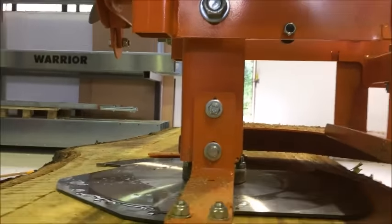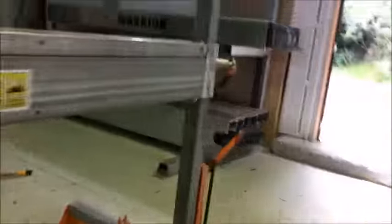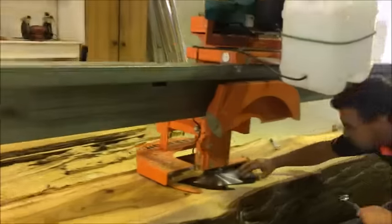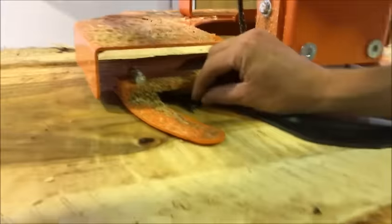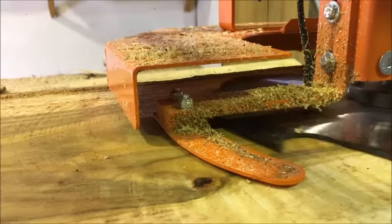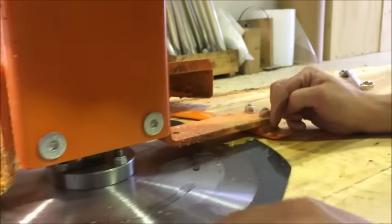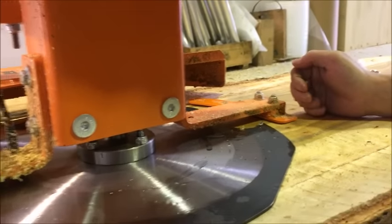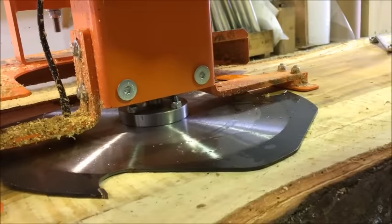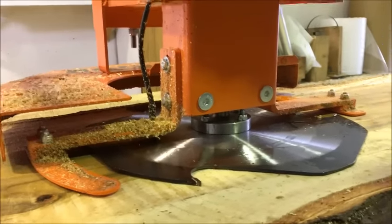So let's have a look at the backside. Need to go around. So we'll bring that tooth around there. So we're about 0.5 mil clearance. We'll roll around, and we're about 0.5 mil clearance. So I know that that's going to cut true, and as a consequence, you're going to get front and back score marks. So it's called the crisscross effect, adjustment one.